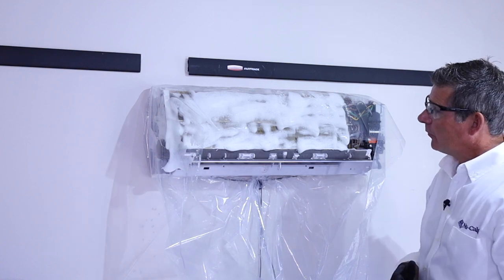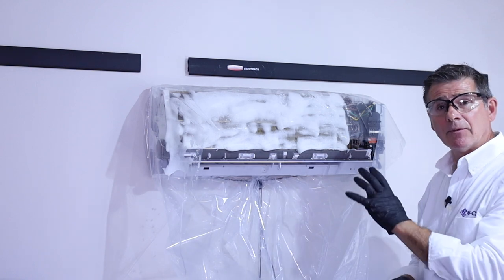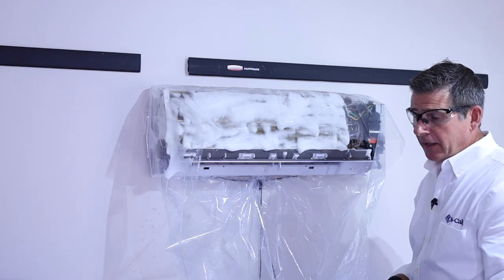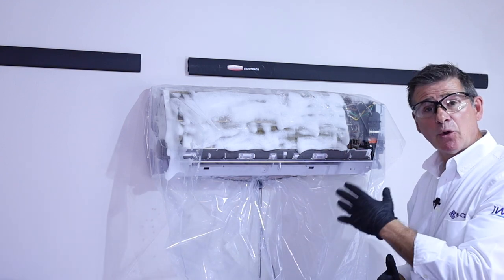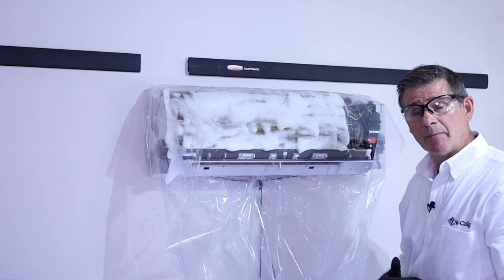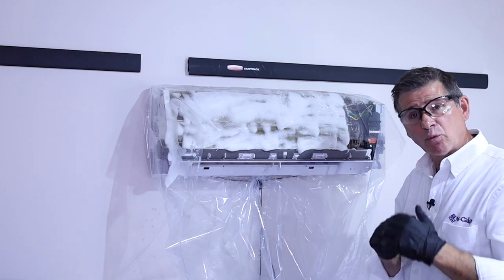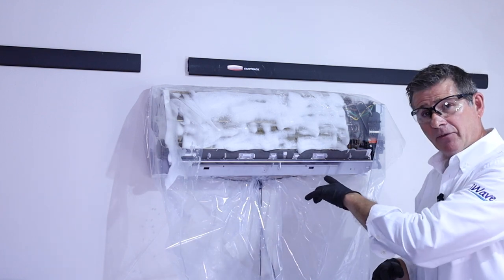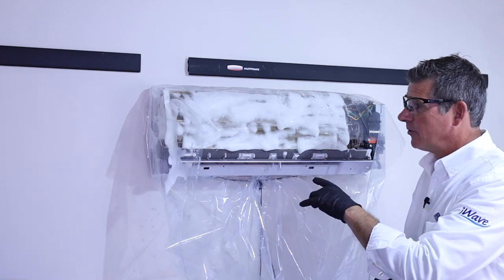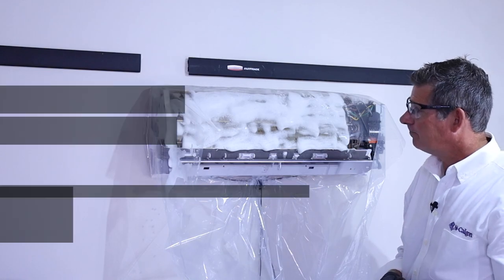We're going to want to leave this on for five to eight minutes and let it continue to clean the coil. The high pressure in the aerosol has basically pushed through the coil itself, helping push dirt and debris out the back, and the expanding foam continues to do that. Once it's set for five to eight minutes, turn the unit back on. We're treating this TriPower HD like a no-rinse formula — let it sit, do its job, then turn the unit back on and close the bag so natural condensation off the coil rinses everything down into the drain. You don't want to do anything with the drain pan or line because we want the TriPower to get into the pan and treat the drain pan and line as well.